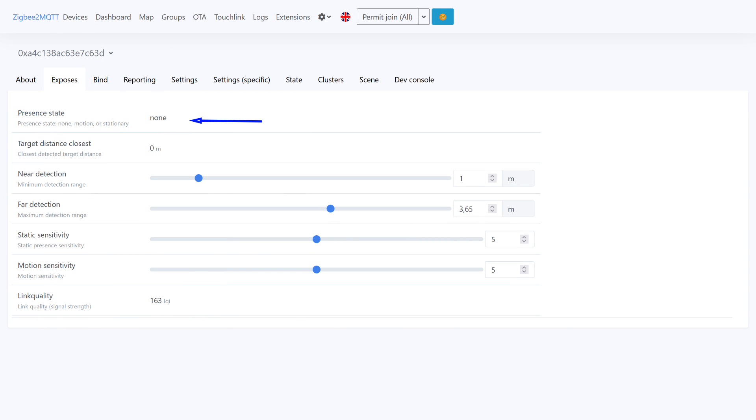Now the Exposes page looks complete. The state shows when the sensor detects no one. Distance to the object is 0 meters. Right now I'm sitting in front of the sensor trying not to move, because it is quite sensitive. The distance reading, as mentioned, is slightly inflated — in reality it's 30 to 40 centimeters. All settings are applied correctly without errors. A wave of the hand changes the status to motion. What I personally miss is a setting for the timeout before switching to no one present — occasionally it might briefly lose presence if you stay completely still, but in Home Assistant this can be solved with a template.